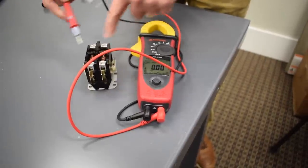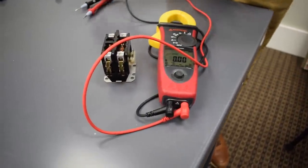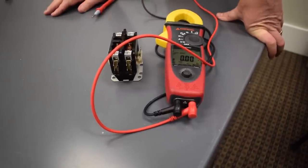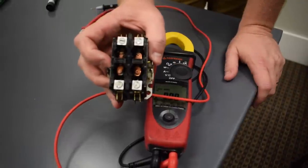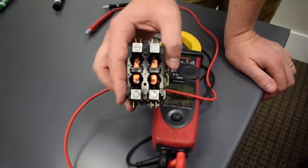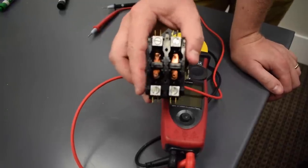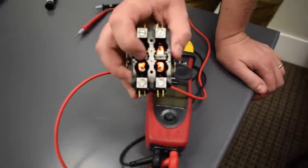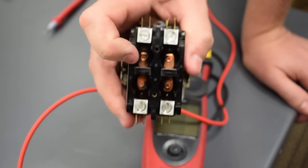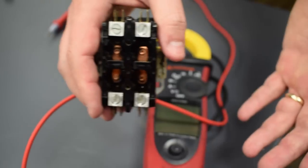And when you have resistance there, there's going to be localized current draw, meaning actual conversion from electrical energy to heat energy. And that's essentially what happens. When you add resistance into a contact point, it gets hot. You can see this set of contacts here has been hot. See all that carbon buildup around the edges? That's generally due to either an overcurrent condition on the entire circuit or these contacts weren't making good connection. This happens in the field a lot when bugs get into it, if something got stuck in there, or just over time with wear as they open and close many cycles over the life. As these contacts make poorer and poorer connection, the resistance is increased, which means that there's current that's drawn here.